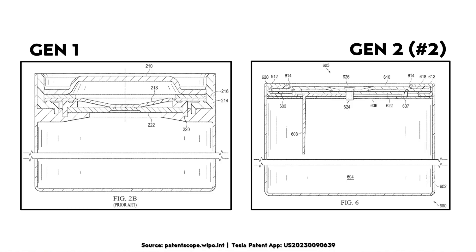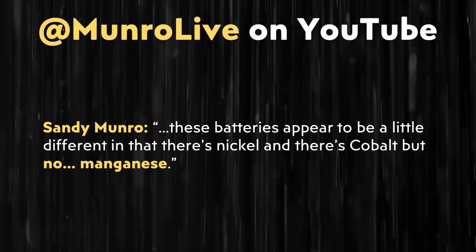However, do note — I'm not sure that they've done a full analysis on this cell just yet, so I don't know if we could be 100% sure on this, but they appear confident that this will be the case. Now beyond the cathode details, which I will discuss shortly, they also confirmed that this battery cell has a new compact cell design that drastically lowered the battery cap profile and allowed more room for the electrode jelly roll.